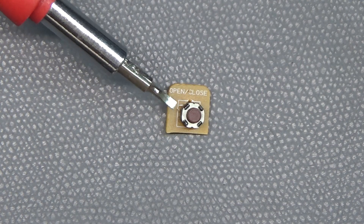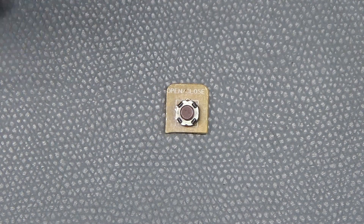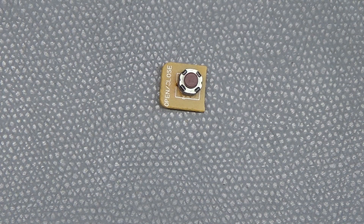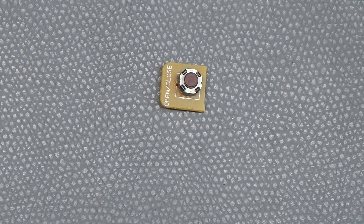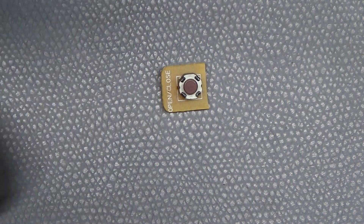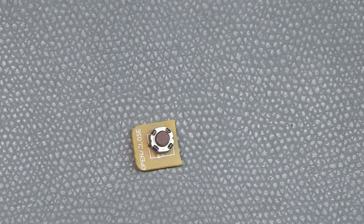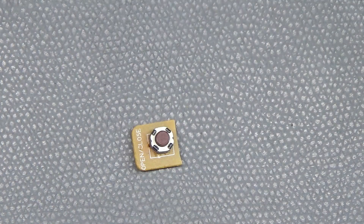This is the button I'm going to use to disconnect or connect the battery. I think I got this off an old DVD player for the front panel display control. I don't know how much current this thing can handle — I couldn't find a model number. It looks like the maximum current drawn for the RF function of the remote is 10 milliamps, and I'm hoping it can withstand that. I'm not going to be cycling this multiple times a day, so even if it burns out I have several more I can use. This is more just a fun project than an actual serious solution.